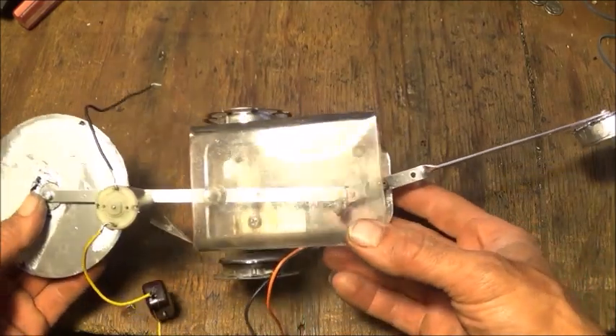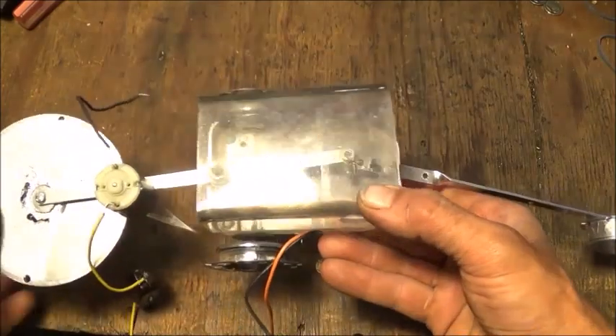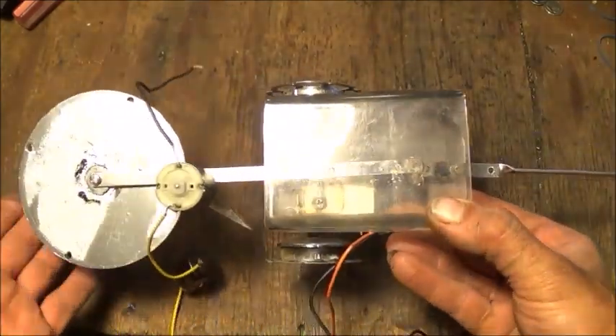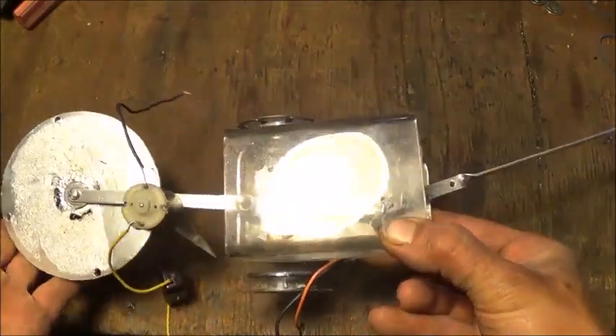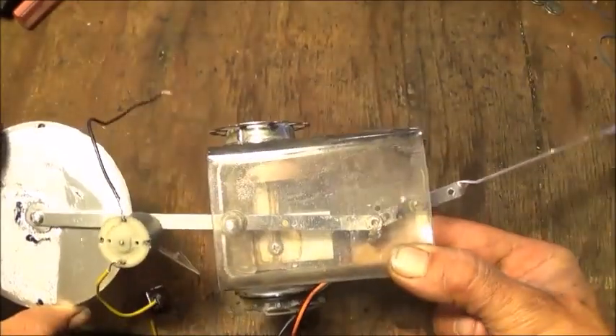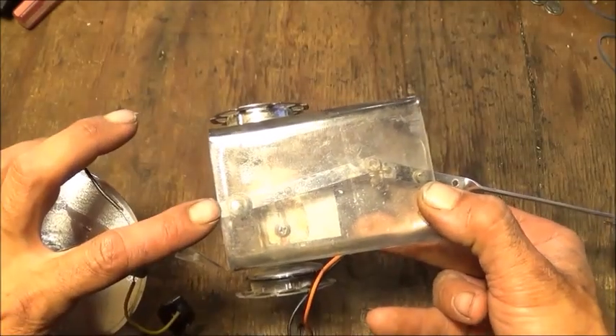The first part of this is going to be demonstrating the steering mechanism. If you look down inside of here, you'll see the entire steering mechanism. This is our front guidance blade. You'll see that later on in our rear steering tire. So when something impacts the front guidance blade, it turns the rear steering tire. A very small amount of motion up here translates to a large sweep on the rear tire. And through the plexiglass there, you can see where the pivot points are — one at the tip of my thumb there, one at the tip of my finger there.